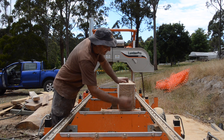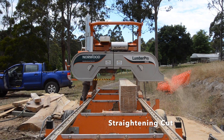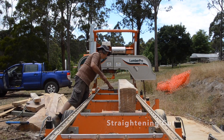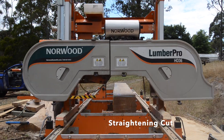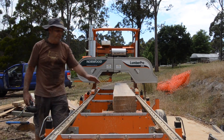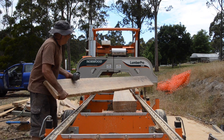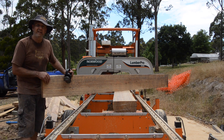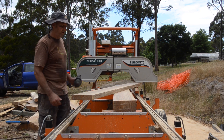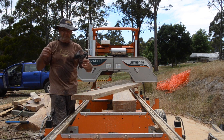Because I'm going to end up cutting that way, I'm going to re-cut this, turn it right over, get the square on the other side, then straighten up and work down. There are the first two boards after all that work. When I came through to the end there was no evidence of spring at all. Here we've got a wide quarter-sawn board and you can see how clean it is — the growth rings run across the face as required for a quarter-sawn board. Now I'll take these off, turn the bottom one over, turn that into a quarter-sawn board, then rework all the others through the process.